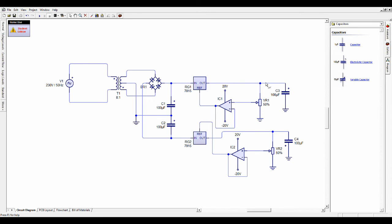Let's talk about the op amp and the adjustment potentiometer. So the output voltage comes through here, goes through earth. You want a reasonably high value of your potentiometer to essentially increase the impedance and get more oomph out of your power supply. Because the more current that goes through here, the less can go through the rest of the circuit, or the load that you're testing.